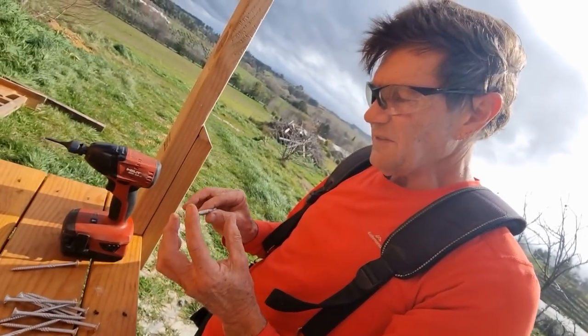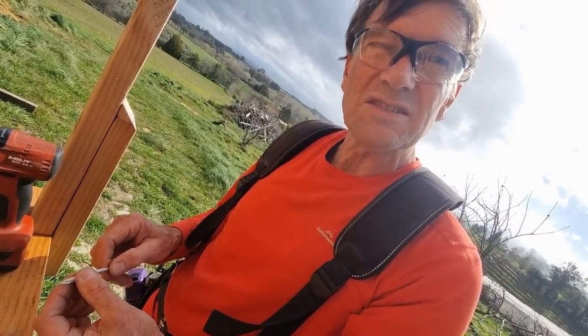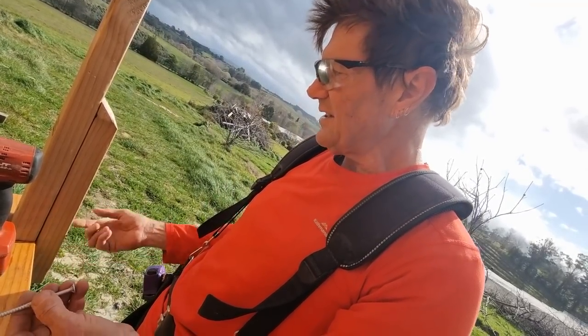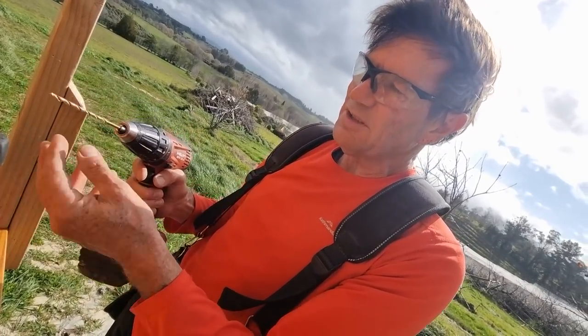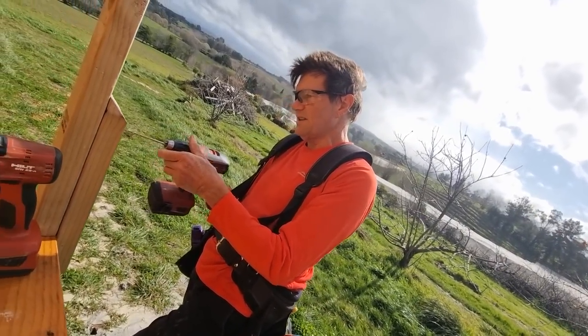But the fact is, when it's outside, you don't actually get rid of any of the sawdust that's in there, so it compresses it around there. And when it gets wet in there, it can make it split. I've seen self-drilling screws split, so if you drill it, then it doesn't split. And I have a long series bit for when I go up to the big 150s, and I just fire it in. It's the easiest way to do it.